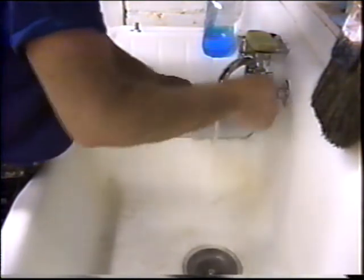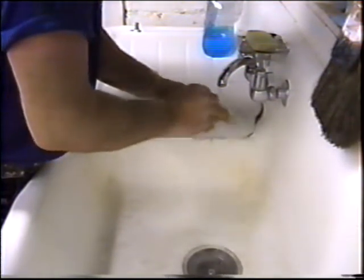Now what I'm trying to do is just clean this part up. A sandblast finish is real good for a lot of reasons. It dissipates heat, and you don't get to see the tooling marks. But in this case, I want to see if this is going to polish up. Any good quality aluminum would polish up relatively quickly. Piece of 600 sandpaper, usually some of that Brillo with the soap in it. Give an idea just how long this is going to take.